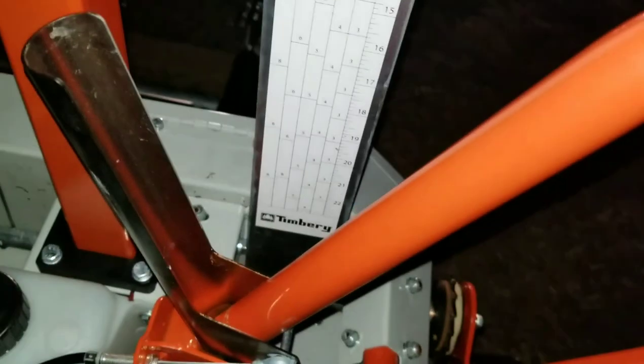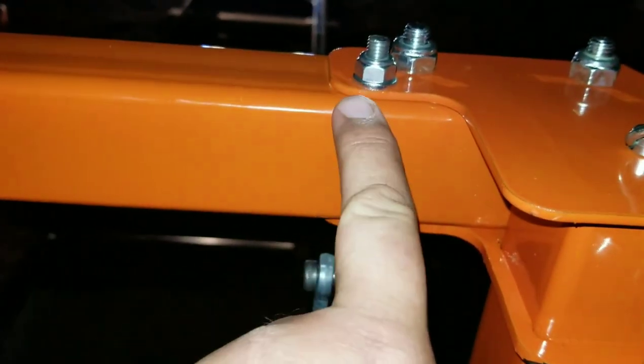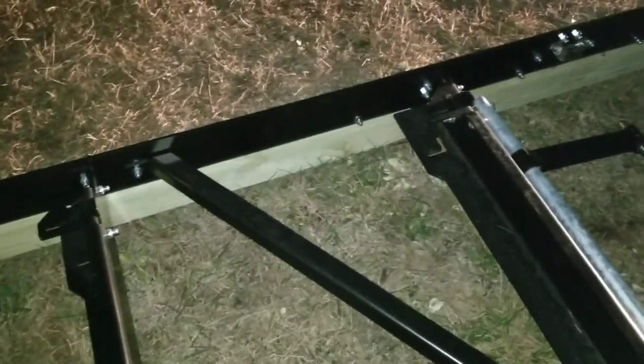We just held this in place, just generically, bolted it down. Did not adjust this bolt. All you had to do was adjust that one to get the blade parallel. And that was a lucky guess on putting this height stick at that height. Don't have to calibrate that. So that's done. Squaring post holders are all squared up as accurate as we can get it without micrometers.